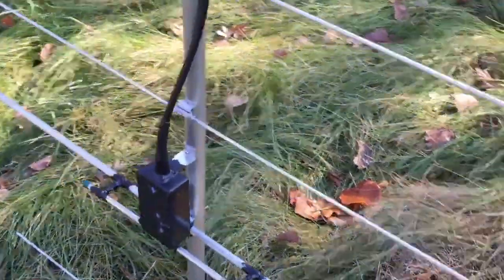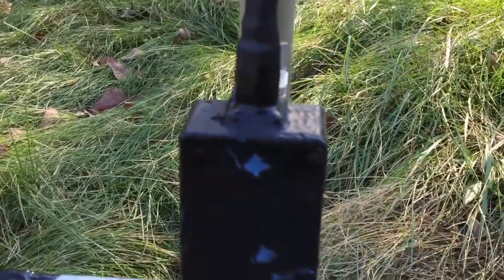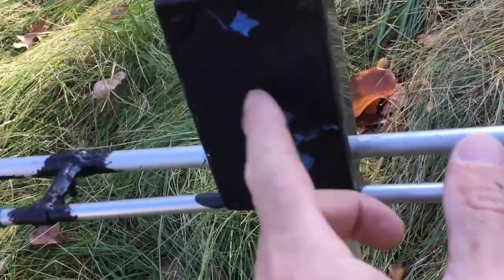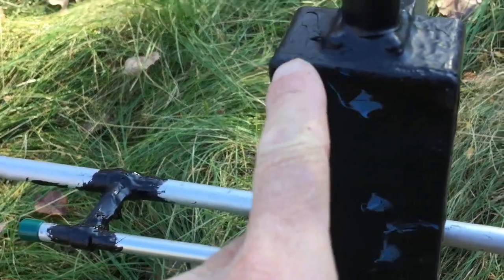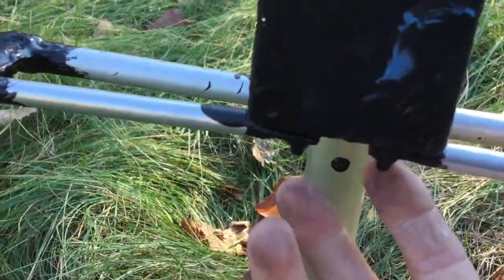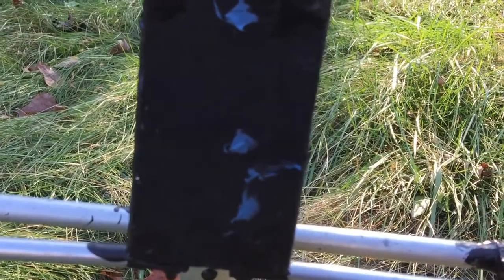These matching boxes are very susceptible to water. As you can see, I'm using liquid tape. If you take this cover off — I've taped everything up so much — there are screw holes everywhere under here where the matching stubs come in. Those entry points, and where the cable comes in — every hole is an entry point for water. I've got several people in the area with these antennas and everybody has the same problem: if any water gets in, the SWR goes to the moon.